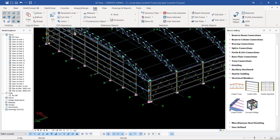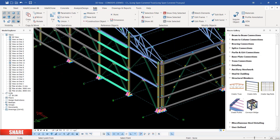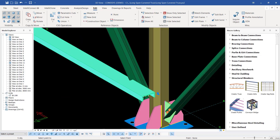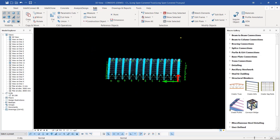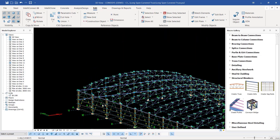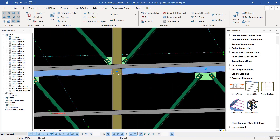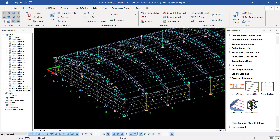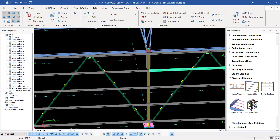Now I want to add some purlins here. I'll press Ctrl and select all these, because during the mirroring some parts were never copied accurately. Once I've selected the members I want, I'll add another one here so that the pattern is completed. If I rotate the whole structure you can see we have all the purlins in place — it's completely done. On top we have the purlins, and I prefer to use circular hollow sections on top and C-sections on the sides.